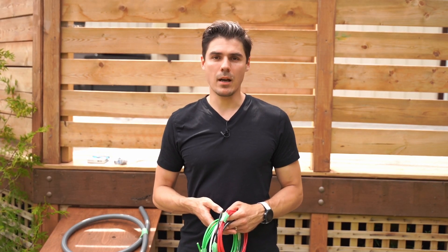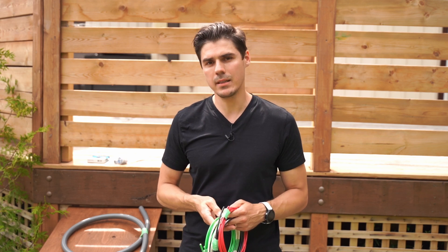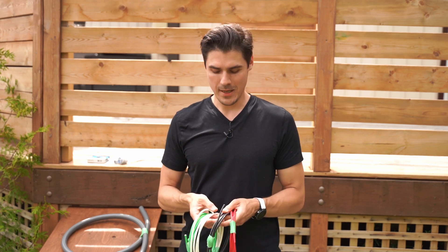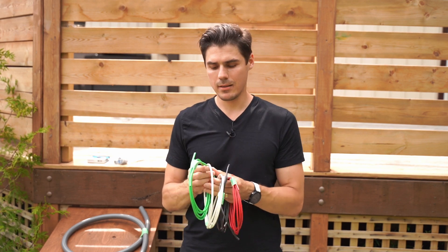For the electrical connection I decided to go with a 40 amp breaker on my panel. According to code, the constant load allowed for a breaker has to be 80 percent of the breaker size, and Level 2 home charging for Tesla cannot take more than 32 amps. 32 amps is exactly 80 percent of a 40 amp breaker. I used 8 gauge wires cut to length from Home Depot — two hots, red and black, white for the neutral, and green for the ground.